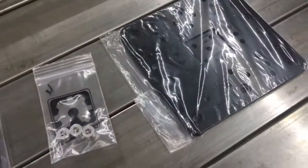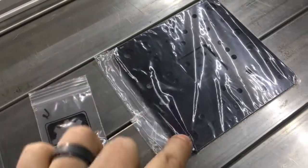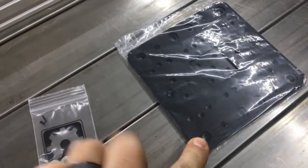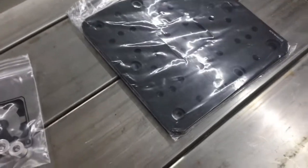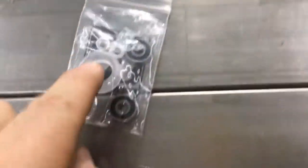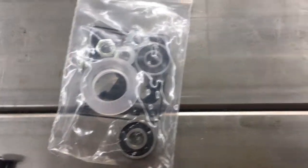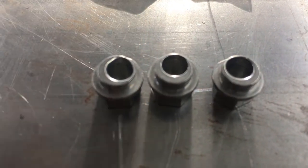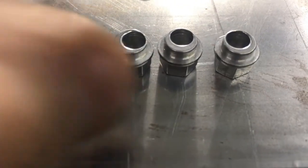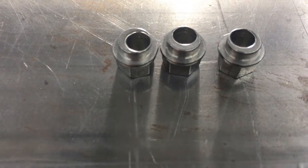This extra large gantry plate comes in two flavors: a six-wheel configuration on the side of the plate, or a four-wheel. I highly suggest if you're going to pony up for this gantry plate size anyway, you might as well get the extra stability with the extra couple of wheels. The baggies contain the bearings and nylon wheels — kind of like skateboard wheels. To adjust the grip on the C-beam or extruded aluminum, there are off-center eccentric nuts you can rotate slightly, which squeezes or loosens the wheels on their track — a nice, ingenious little system.